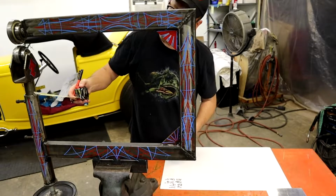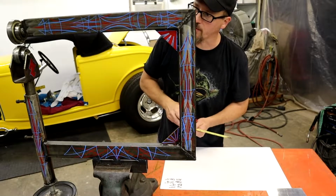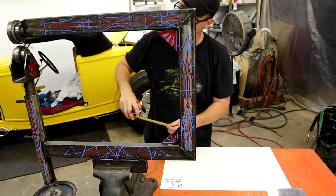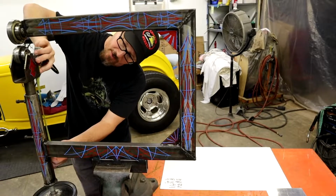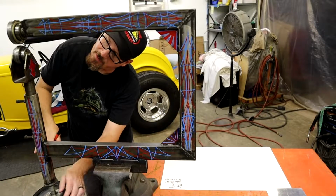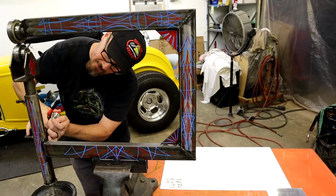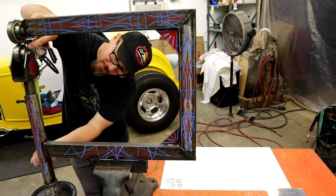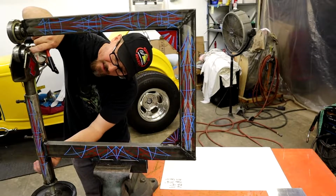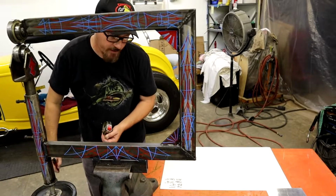And I think our key shaft, if I remember, because this design here, you can't really take it apart to get it out because it just comes up and hits the way I made it. Probably should have made it a little different, but the key shaft, I tried to keep it as short as I could because this stuff's pretty expensive. So you only have, let me run it all the way up, that's all you got here. So from here, you really only need 8 inches, but I'm gonna say be safe and go 11 inches on your key piece.